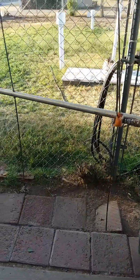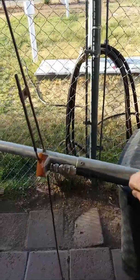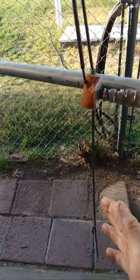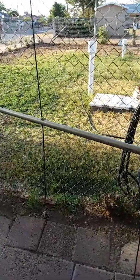It has a driven element, a reflector element, and director elements. And to show you the difference, if you look right here, the coax, the feed, is coming up here, and it terminates at this element right here. Well, this is your driven element. This is the element that actually emits the signal. Now, since it is a beam, it's directional and goes in the direction that you point it, primarily. So, that being said, this is your driven element.